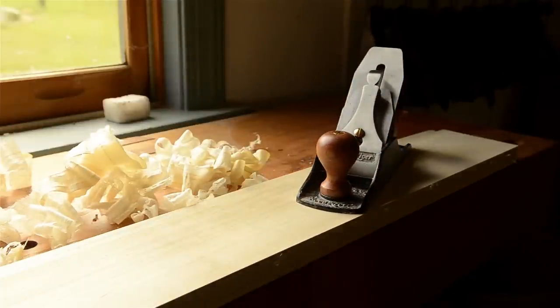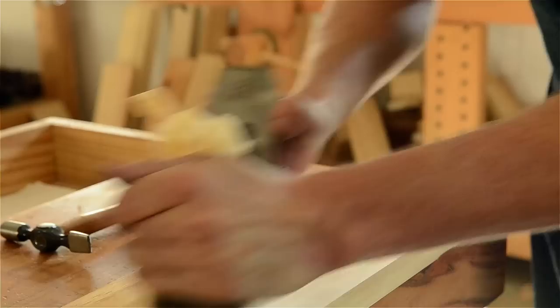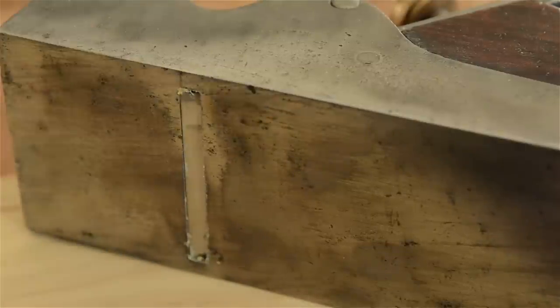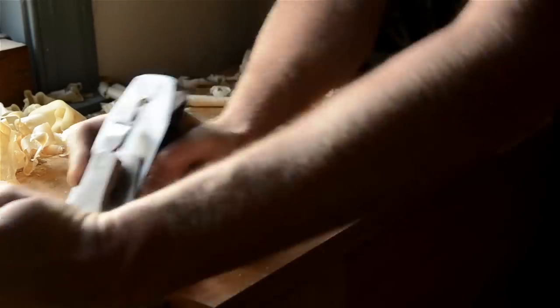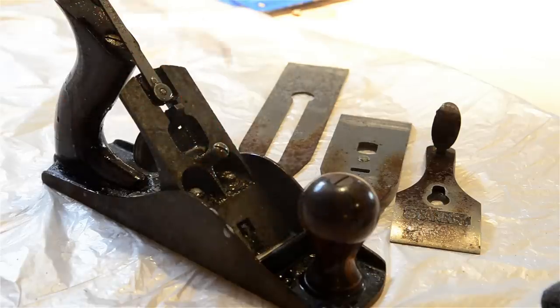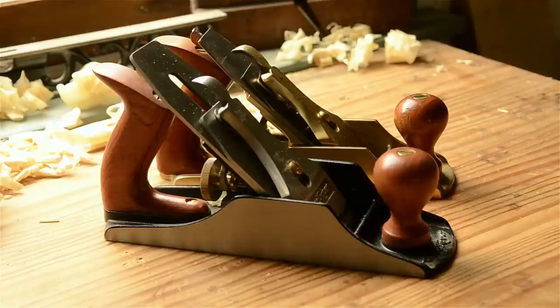I mention specific brands and models in my article. If you've got a much larger budget, I really like the Scottish infill smoothing planes — not only are they attractive, but they're heavy and precision made with tight mouths and solid bodies, which makes for excellent smoothing. But to be honest, I've found that a Bailey style smoothing plane works very well without chatter if it's highly tuned and oiled or waxed. Comment below if you'd like me to make a video on highly tuning up a hand plane. The biggest problem with rehabbing a vintage metal bench plane is the thin chip breakers, which can give trouble if you can't close the gaps, leading to chattering. A rehab should only take about a day, but if you'd rather spend your time woodworking than rehabbing, then a new Bedrock style hand plane may be the right choice.